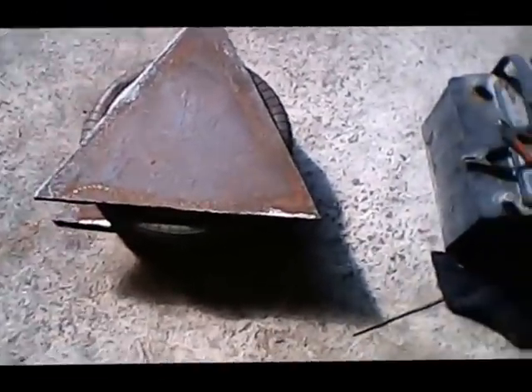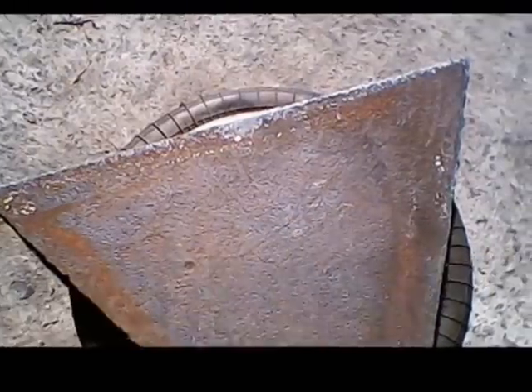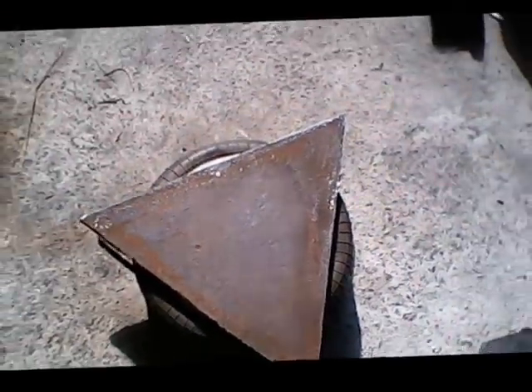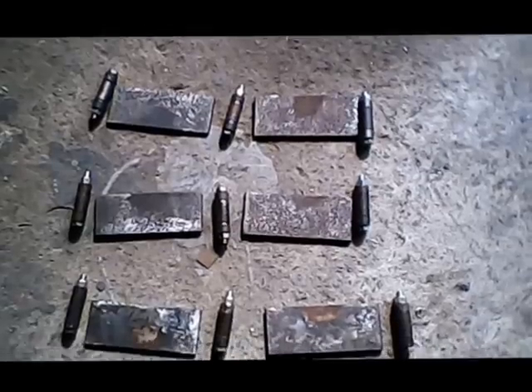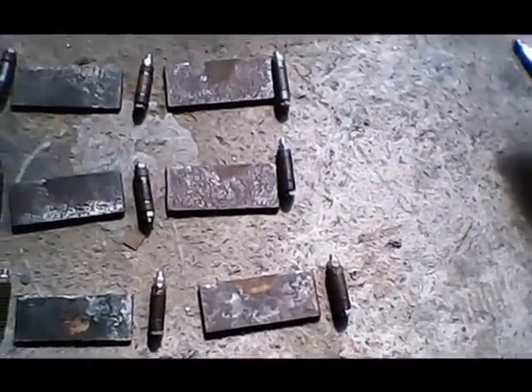What I've done is cut out two triangles — I think it was actually three-eighths inch steel, probably rusted down to about five-sixteenths now, but it's just some old steel I had. The airbag is about 14 inches in diameter. I've cut out six quarter-inch plates, added some scrap, and made 27 bushings. Basically I'm making three hinges.